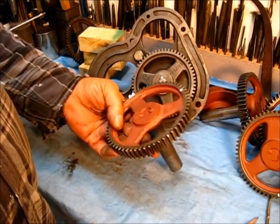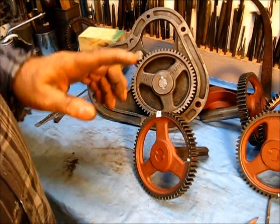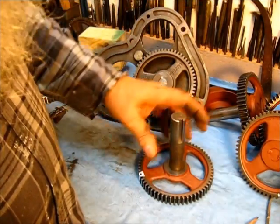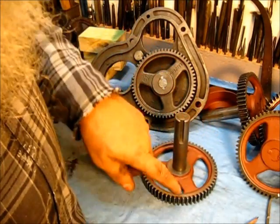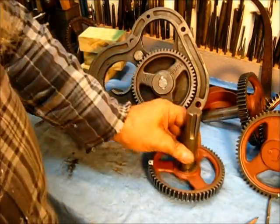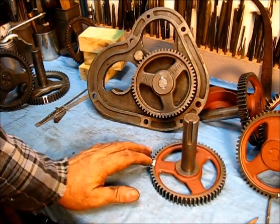A couple of these were from late-model EK type equipped engines. I will use that 16-tooth count when I replace this shaft — put the shaft in, orientate it so the keyway lines up with the 16th tooth, then drill the two holes and pin it fast. That's how you get the timing set back to the original factory marks.